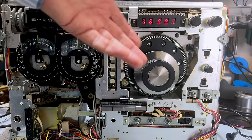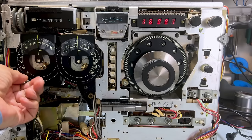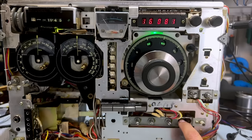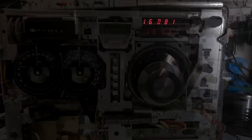There is a very easy mod where you can put a little PCB with a diode, resistor, and current limiting resistor — very simple, with a little capacitor to smooth it. I thought I'd do it differently, and I want to show you the result — you tell me what you think. This is on at the moment. The lights aren't on unless I push the light button. There we go — you see that? That's an old one. This is the new one. That is the new dial lamp behind the shortwave. Let me put off the lights and show you what it looks like. It looks beautiful — just about the right brightness.